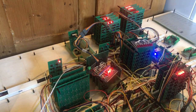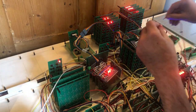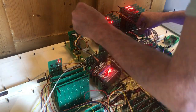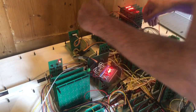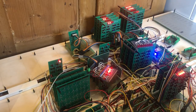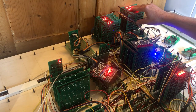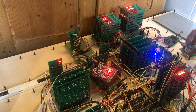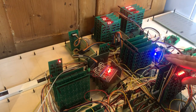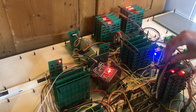Okay. Now I'm going to do A out and ALU register 1 in and ALU register 2 in. So A out, and they're over here. 1 and 2. Now this register is a special one, this is a general purpose one, here you can decide whether you input it or output it. This one is special because it always outputs the value to the ALU. And here is another register, the ALU out register. If I activate that, it should adopt the value 12 plus 12 should be 24. Hope you can see it, but it's 24.